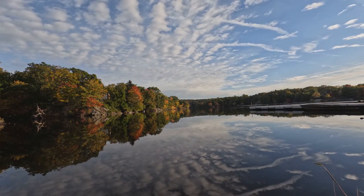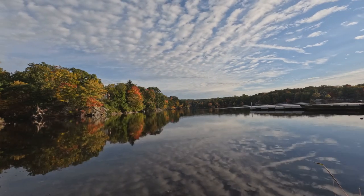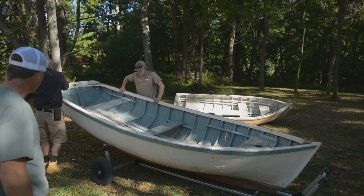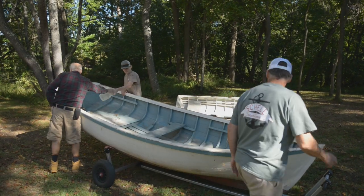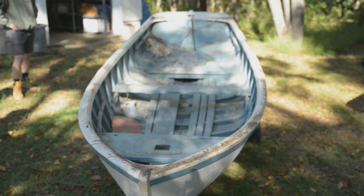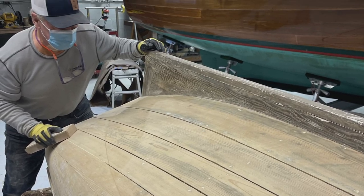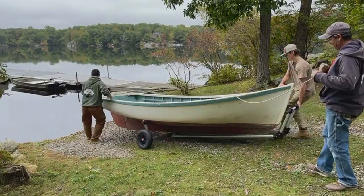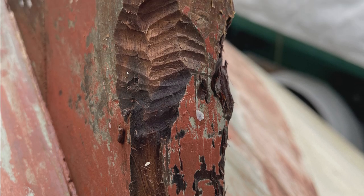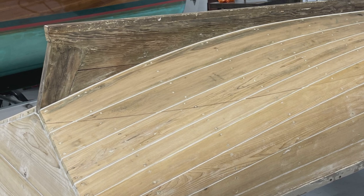When we brought the Abaco dinghies back to the shop, we went through them pretty thoroughly and found there were a few parts missing. One of the thwarts was missing out of the big dinghy, so we removed all of the existing thwarts and the floorboards. When we flipped over the 14-foot dinghy, we realized that back in the fall when we put the boat in the water, a beaver had gnawed away half of the skeg and keel. So after a few Dutchmen, she was back to normal.